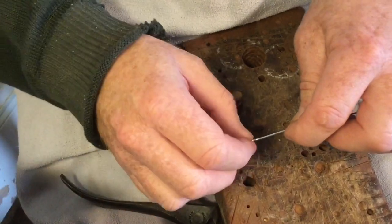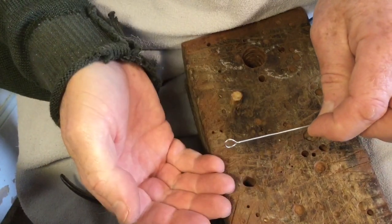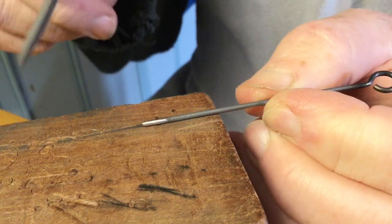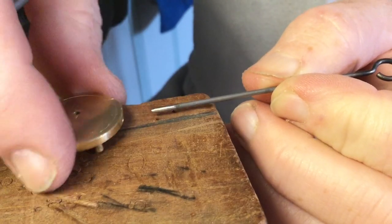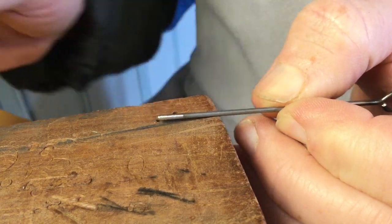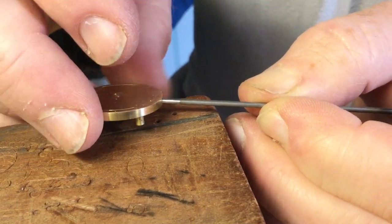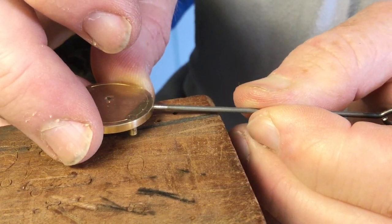You can clamp it and bend it so it's all nicely in line. The other end of the handle for the pallet warmer I'm filing down and reducing because it doesn't go into the hole as-is. I filed a bevel on the end so it hopefully won't throw up a burr as I push it in, and I'm carefully reducing it down to a sort of jam fit — the first part goes in okay, but then it's a bit of a jam fit, which is what we want.